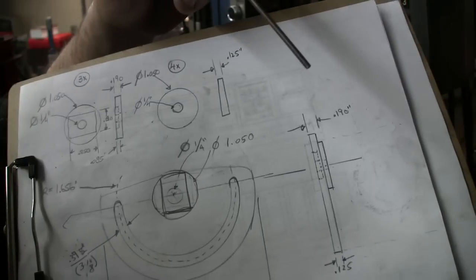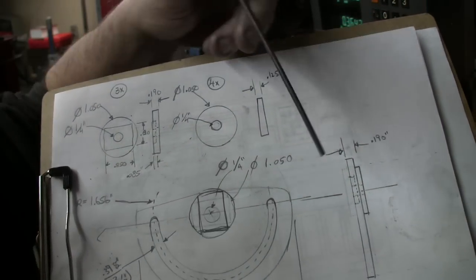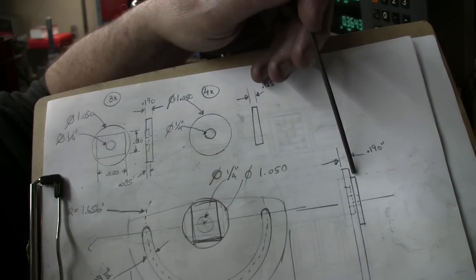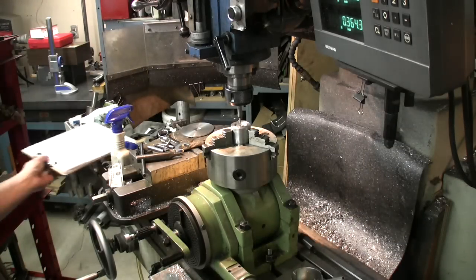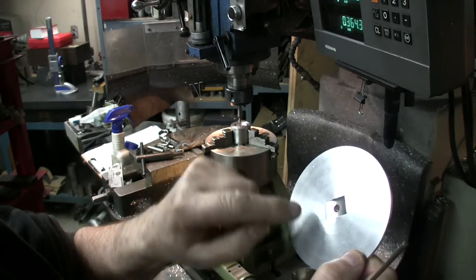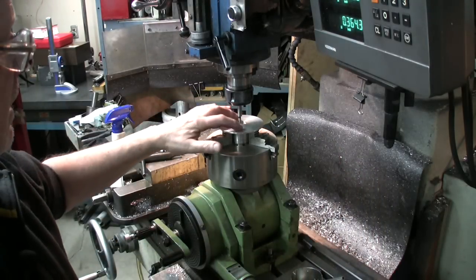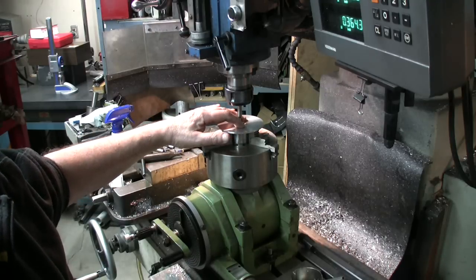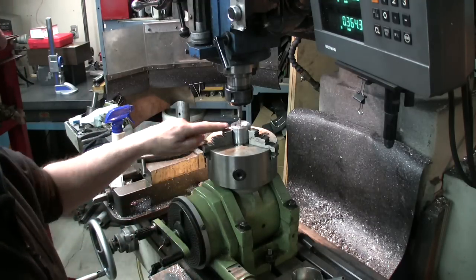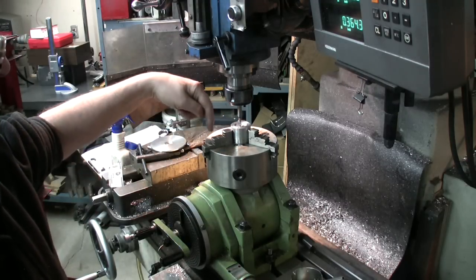And there is a little hub there that's going to be used to hold into the central pivot, and also this time we're going to take advantage of this to center our stuff on the rotary head. Okay, physically what it does is the round groove there, the hub in the back, fits perfectly with this. It's almost perfectly registered, and we'll find center with the center finder. After that, put the plate on this, tie it up, line it up, and make the groove semicircular.